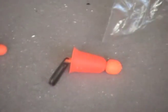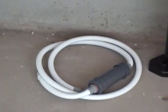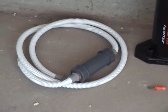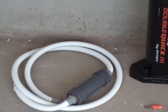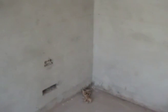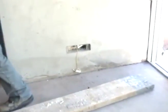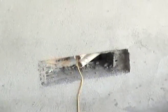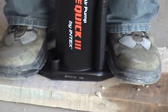We tie the string to the shuttle and suck it through the conduit, through the PVC pipe. This is the filter and the flexible 20mm conduit that we attach to the pump. Boxes have been installed in the walls by my electrician in this room — there are various boxes all around the room. On this pump we have got a blowing tube and a sucking tube.